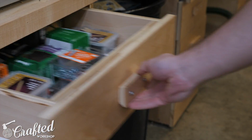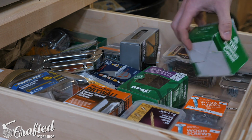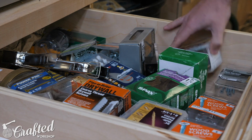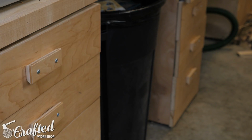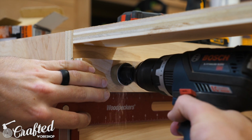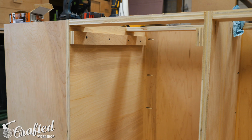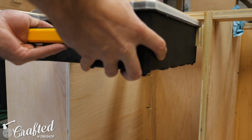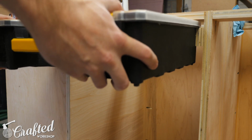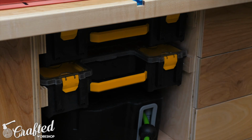Another big part of the assembly table was effective storage for screws. My current drawer is a total mess with zero organization, and since all the screws are in boxes, I can never tell when I'm running low just by looking in the drawer. I found some of these screw storage boxes and figured it'd be easy to build a little area to house them, similar to what Adam Savage has with his Sortimo boxes. These boxes are a whole lot cheaper than Sortimo boxes and have pretty much all the same features, so to install them into the cabinet, I just added little plywood rails, but forgot that I was supposed to build them out of 1/2-inch plywood instead of 3/4-inch plywood. I just went back and planed the 2 strips down, but you should just make them out of 1/2-inch plywood, and that's what the plans call for.